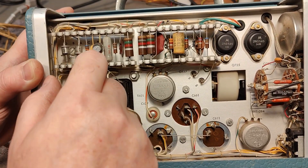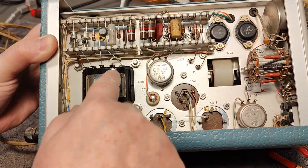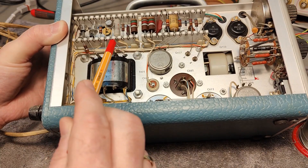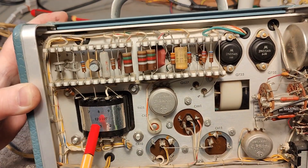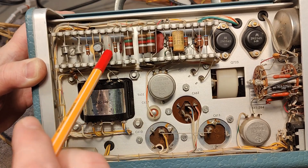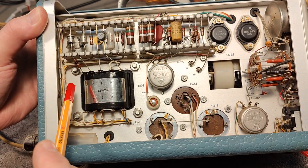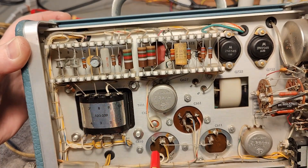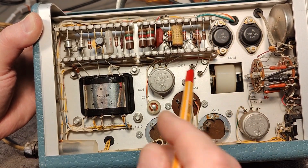This looks a little bit weird. What is going on with this diode? You've got some two AC outputs that go to some diodes — and then what? It appears not to go anywhere. That is some weird stuff. Overvoltage protection or something? I better consult the schematic. Here we've got four diodes — this looks like a classic bridge with a little current protection resistor. Those wires probably go down to the capacitors for the oscillator or power supply.